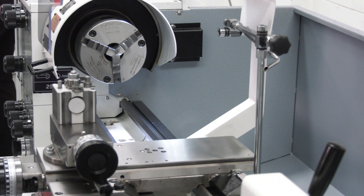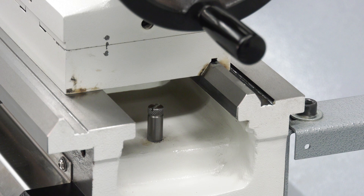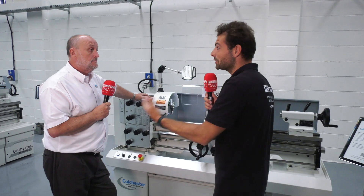This is actually a metre between centres. We do a slightly shorter one at 635, so a really nice compact machine — a tool room type grade machine. At the metre size, you can fit pretty much 80% of your parts if you're just doing general sub-contract work. We can supply steadies with it as well, so you can do loads of shaft work. It's a gap bed, so you can do some bigger diameters too.